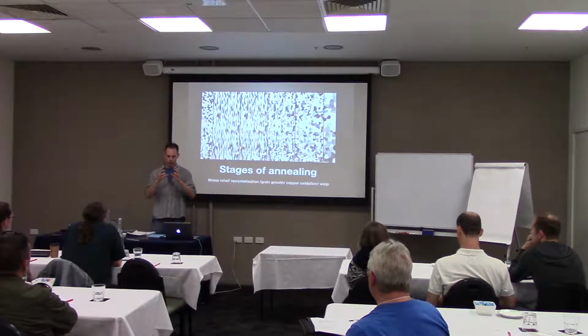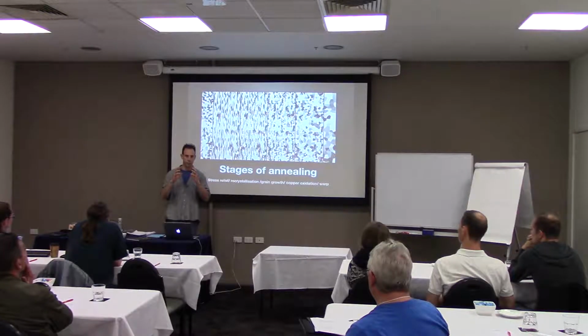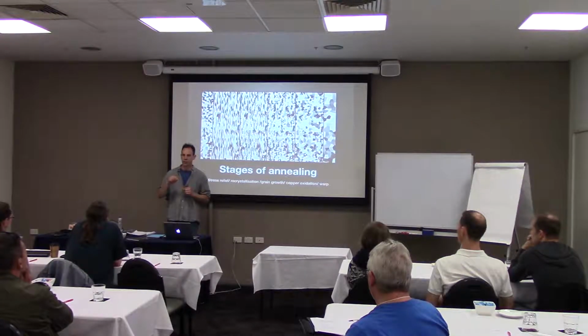And now you're going through this stress, and all of a sudden those edges are becoming strained on the faces of that grain. Go back. There's a grain boundary that has also been formed at the same time. All of these grains are sitting next to each other, but around them is this little electron boundary. It has a lot of the impurities, little trace elements of lead or tin or whatever it is, and they'll kind of migrate to those points.